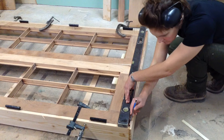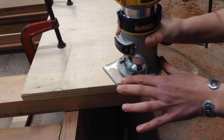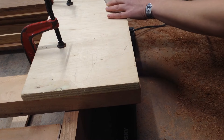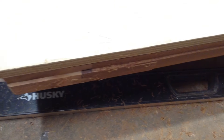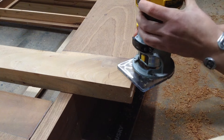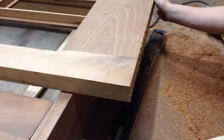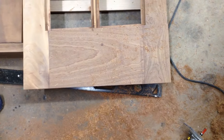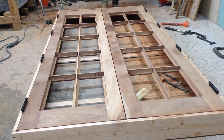I'm going to go through this process real quickly just so you can see the final piece. If you're interested in how to make these doors and the whole process, I'll be uploading this French door build probably starting next week. I made a straight edge on top and bottom, and I used a piece of plywood with that longer pattern cutting bit in order to even out both of my edges. I'm going for about an eighth-inch reveal, so since these were mounted in there a little crooked, I'm taking off more material in some parts than others. Once I'm about halfway down the door, I can remove the ply because the bearing will now follow the straight edge of the door. There's more like a three-sixteenth groove in the middle versus an eighth because this wood will swell in the summertime.